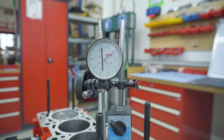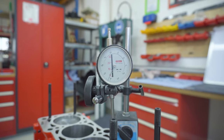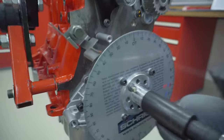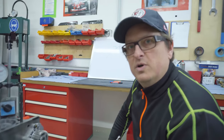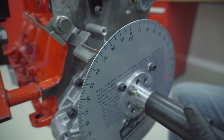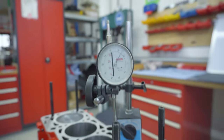Double check — we have the red point there. Now we do one millimeter on the gauge. Actually it's more than one millimeter — you can make two, three, or five, whatever — just make the same on both sides to get an average value. We go from zero, one full turn on the gauge, and we have 35 degrees. Because we made the German video before, I know this is spot-on, so it's a bit of a bad example. Now we have 35.